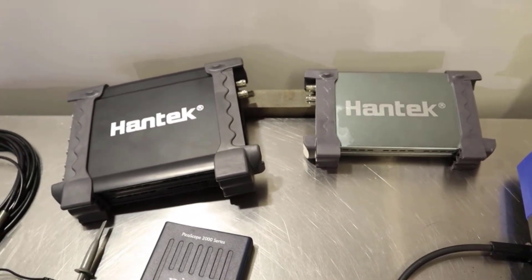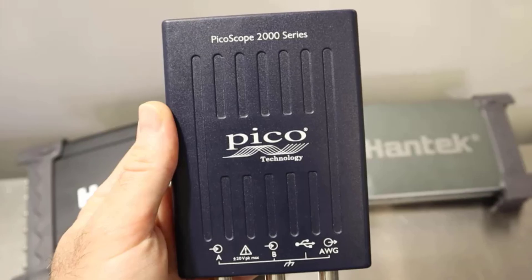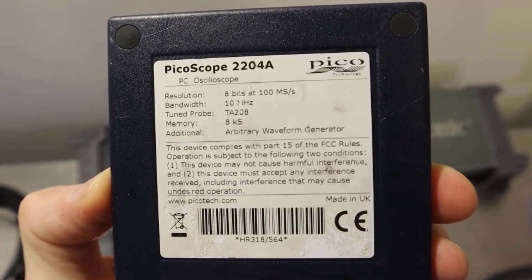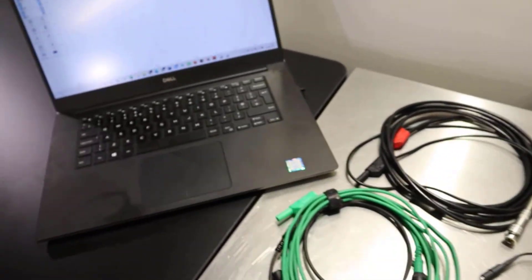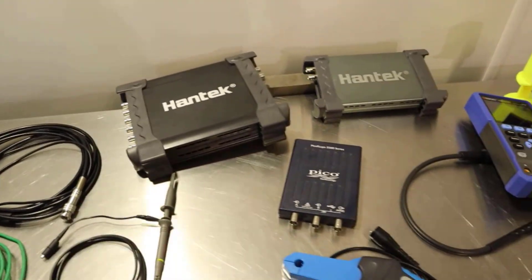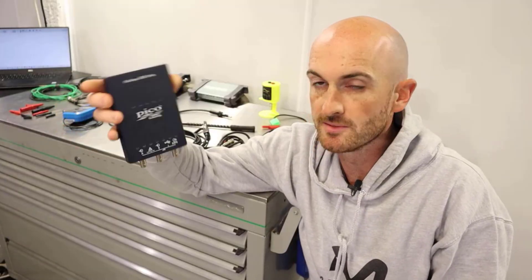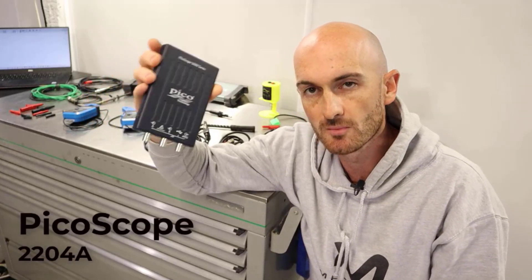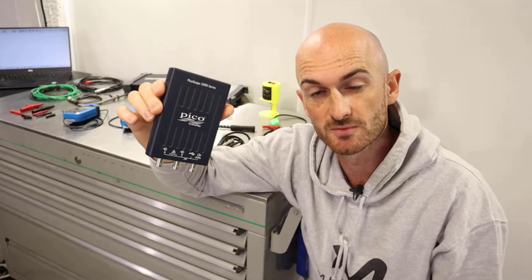There are a couple of other software alternatives you can go for, however I generally always recommend the PicoScope 2000 series, in particular the 2204A, to get started. You can get this oscilloscope for around about a hundred dollars and it's a very powerful bit of kit. The software - I'm really getting used to PicoScope 7 now - has just got so many features that you can really make the most of that cheap little oscilloscope, which costs less than my multimeter. I was pretty impressed with this the first time I used it, having been using the automotive oscilloscopes before, and the oscilloscope software is pretty much the same between the two scopes.